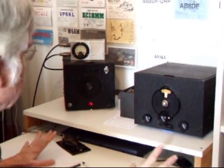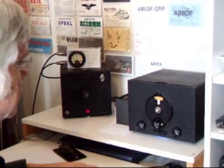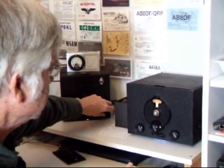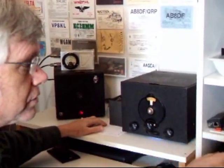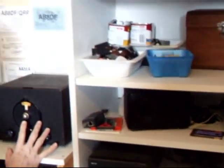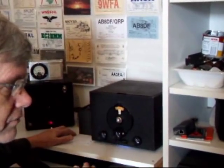The transmitter is set up now. We need to get the receiver on frequency. One of the things about a regenerative receiver is it's radiating a signal when you are listening. With my ICOM 735 set on the transmitter frequency, we need to get the receiver on that same frequency by listening for the regeneration signal from the receiver in the ICOM 735.